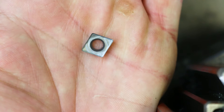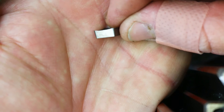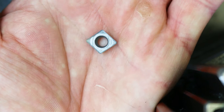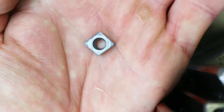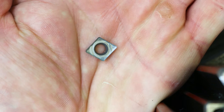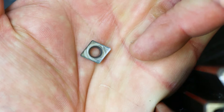This is the CCGX uncoated tungsten carbide insert with a very high positive rake angle. It's designed for aluminum, but for taking fine finish cuts in leaded steel it works okay. It can be difficult to get a good surface finish in steel because it likes to tear. This tool has worked reasonably well, although it's very fragile and prone to breaking. We can only use two sides — we can't use the bottom because it's a positive geometry with a built-in relief angle. So we only get two cutting edges. These inserts are expensive, fragile, and we don't get as many uses out of them as with other inserts. Please be careful with these.